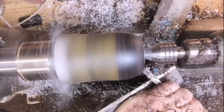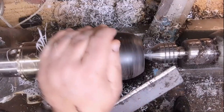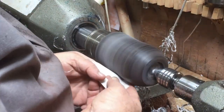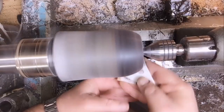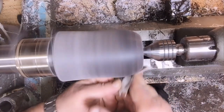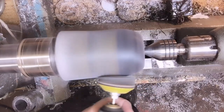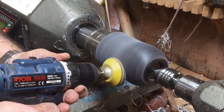This black African wood is making an unbelievable amount of dust. It's worse than Padauk — it goes everywhere. I mean, everywhere. I'm going to sand from 150 all the way to 600, and then I'm going to use water pads to sand. After the water pads, I'm going to use the Novas all the way.